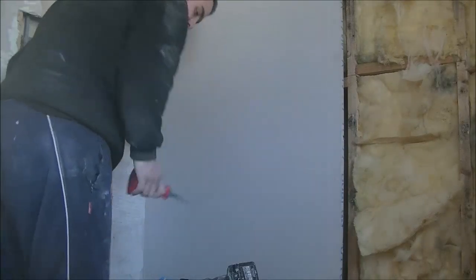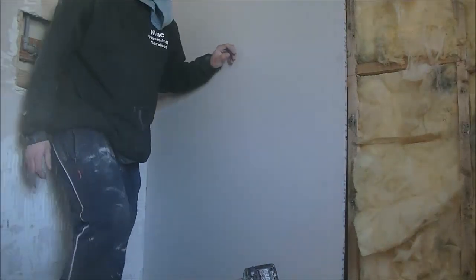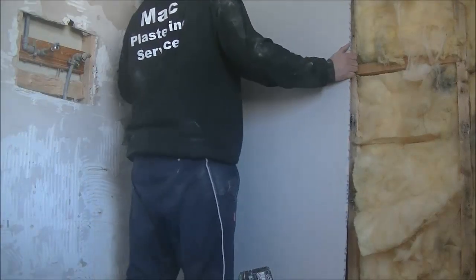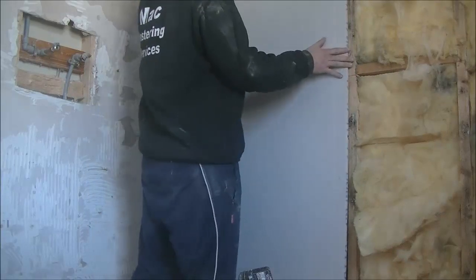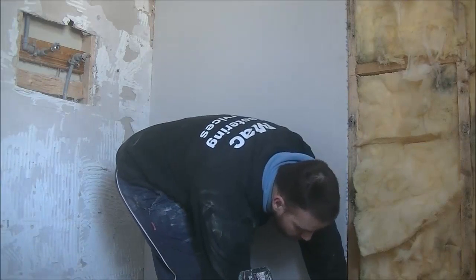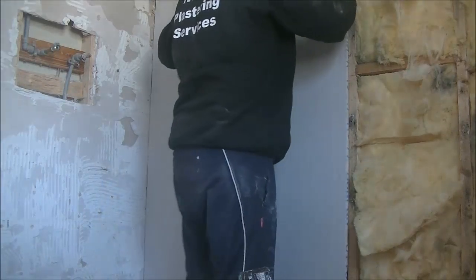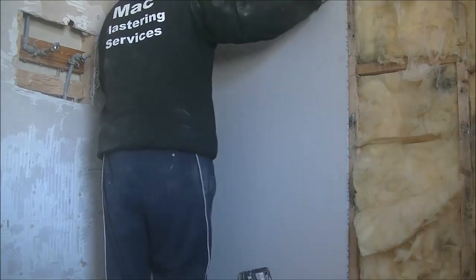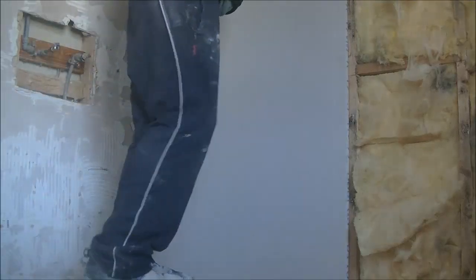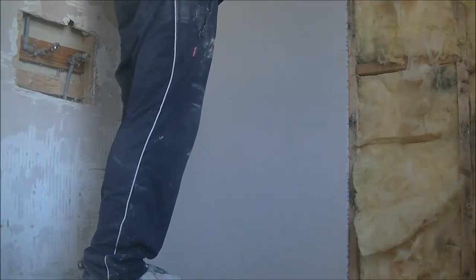The board is just cut slightly under so it will definitely fit. You're going to want to prop it up — as I'm plastering the ceiling and wall here, I want to close that top joint and the left hand joint as tight as possible. That will make skimming easier rather than having to fill a big massive scrim joint. The way I'm doing that is just using the chisel to wedge it up. That's lovely — fitting in nice to the top and nice to the left. That's when you know you're going to get it screwed.